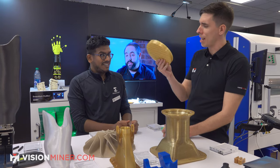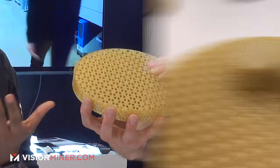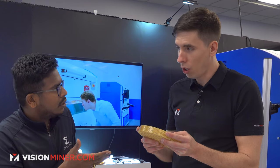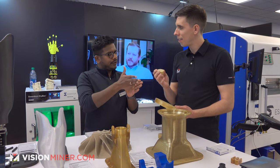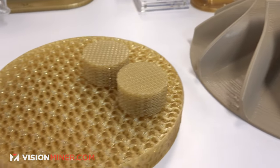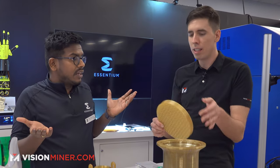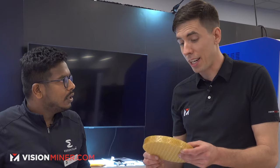We've got some really interesting examples — I can see the gyroid infill. So it's a gyroid infill, and it lent itself very well for a customer who wanted a crude oil filter. It needed to be inline, requiring a high chemical resistance material. Their current supplier only makes filters in certain grades, but if they want a medium grade, they can't get it. With 3D printing, they can. It's not even designed in CAD — it's a simple cylinder with a gyroid pattern at a specific infill percentage. That is so smart.